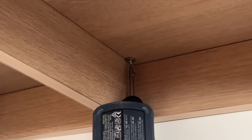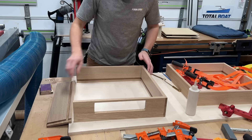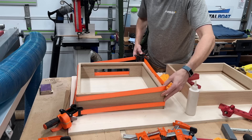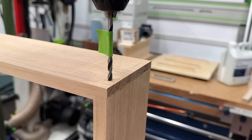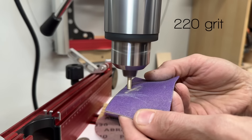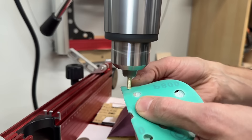I know that gap looked big, but it was really about a 30-second. When we come back tomorrow for the final time, I'll show you what it looks like caulked and painted. Back home for night shift to finish up these drawers — I'm not gluing in the back of the drawer because we still have to slide in the bottom, but I wanted that in the assembly to keep everything square. I've actually never used band clamps to glue up a drawer before, but it actually gives a good amount of clamping pressure and it's way easier than wrestling with parallel clamps. To pin those rabbets, I'm using 3/16th brass rod, cutting that on a metal bandsaw, using a magnet for a stop block to get them all a consistent length, and a tape flag as a depth indicator to drill out for the pins.